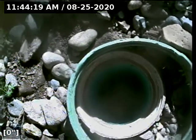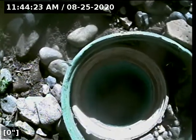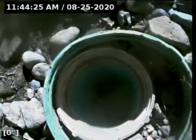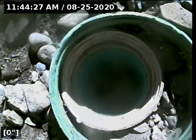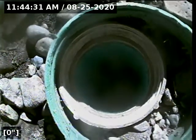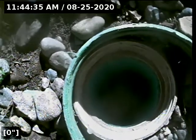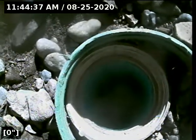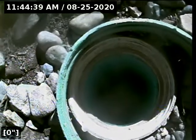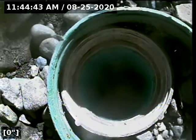We are at 4909 Purdue Avenue Northeast. We are doing a sewer scope and we are accessing a four-inch green plastic waste line clean out on the north side of the building. We have water running through the basement sink on the north side and also on the south side of the building. We want to see how that water comes into the line, how they're connected, and where the line goes.